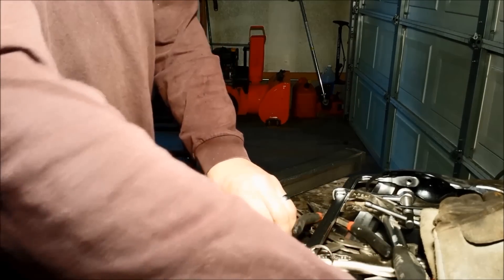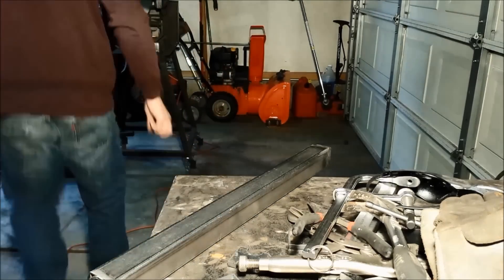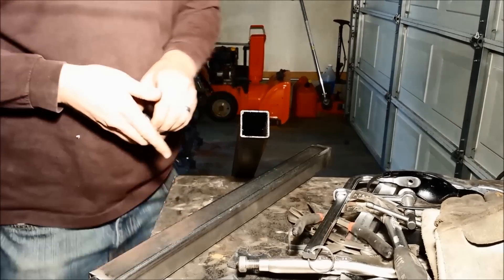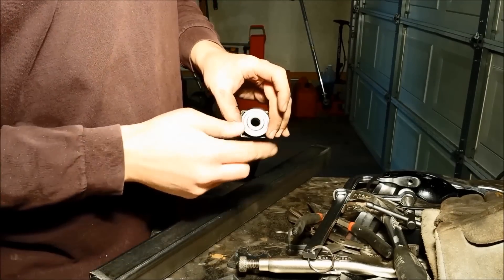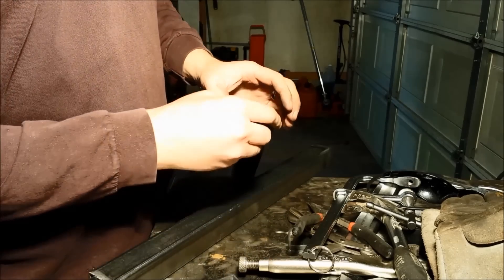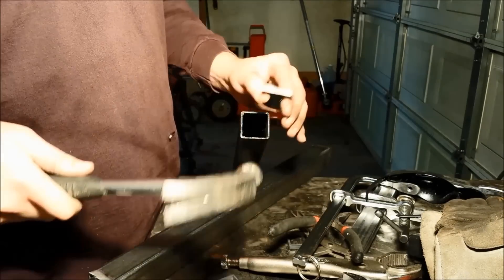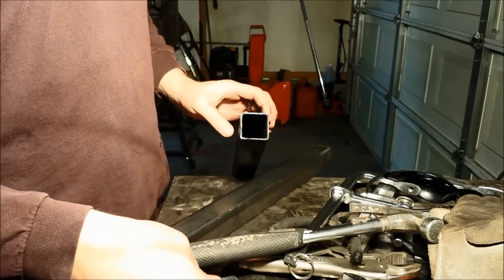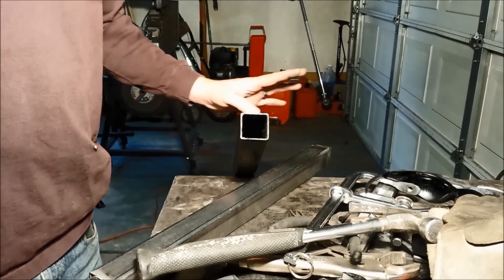One thing I want to mention: these bearings I picked up — this is inch and a quarter tubing — but if you take a look at this bearing, it does not fit inside that tubing. It's really close but doesn't fit, and I didn't want to hammer it in and cause any problems with the raceways. So what I ended up doing is creating a little wedge tool. It's inch and a half on the very end — I just hold it here, hammer this end just a little bit, and I can knock it and hammer it, which gives it enough space that the bearing slides straight in without any issue. Let me know what you think, and stay tuned for more update videos.